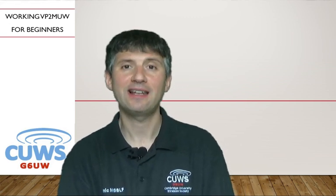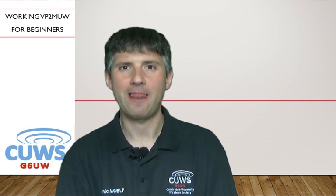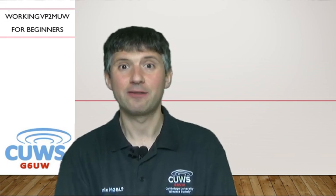Operating split like this has 2 main advantages. First of all, it means that you're more likely to hear me if I reply to you. In other words, if I replied to you and the pile-up was still calling, and the pile-up was on the same frequency as me, then you might miss my reply. By separating the receive and transmit frequencies, the pile-up should never stop you from hearing me.